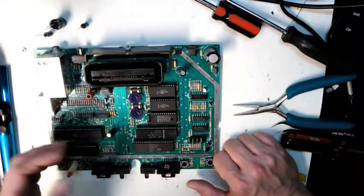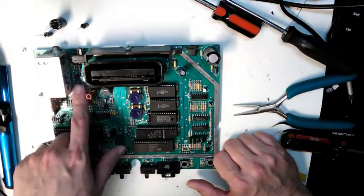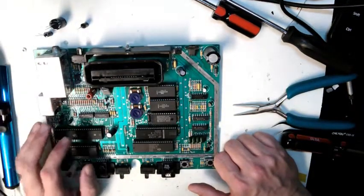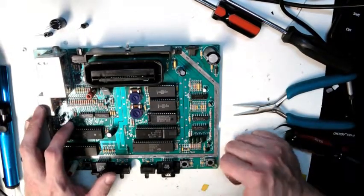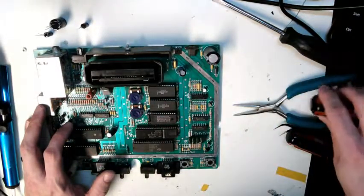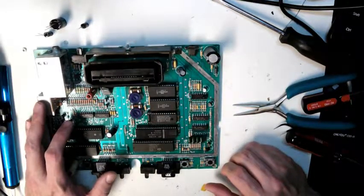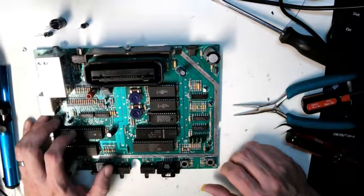And it's actually built into the board now. There's the lumas and chromas here, and they'll go through a transistor, and those get summed up and then get sent over to the RF. This box here is the RF modulator. There's actually a really simple mod if you just want to do a composite. You just pick off a couple points here, you sum them together, and voila, you have the composite out. The composite's already on there. It just gets fed through this RF modulator first.